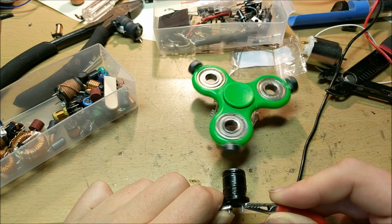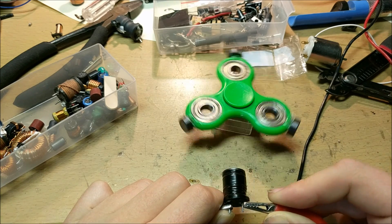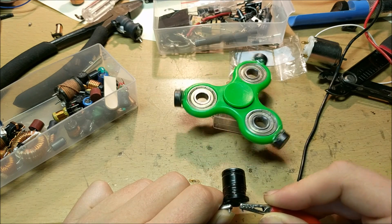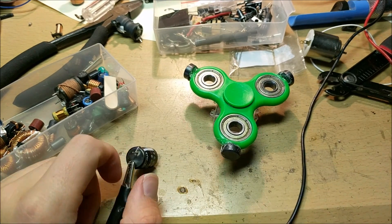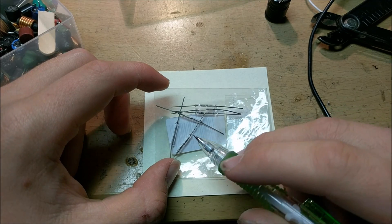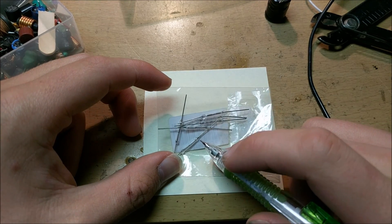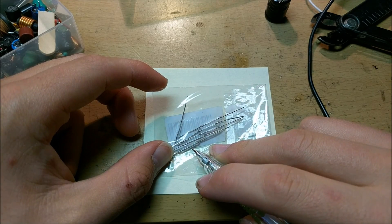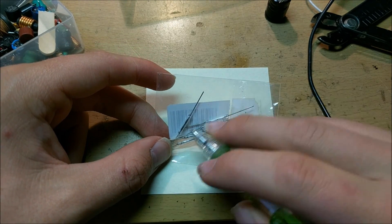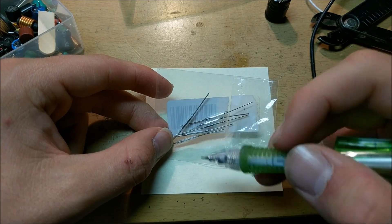This task is kind of hard because you have to be constantly tapping and you're not getting it to the right rhythm for the fidget spinner to spin as fast as it possibly can. So for this task we're going to need something called an electromagnetic reed switch. A reed switch is a tiny switch that only closes when it is in the presence of a magnetic field. This means we can use it to sense whether there's a magnet, turn on the electromagnet to attract it, and then turn it off when the magnet goes away.